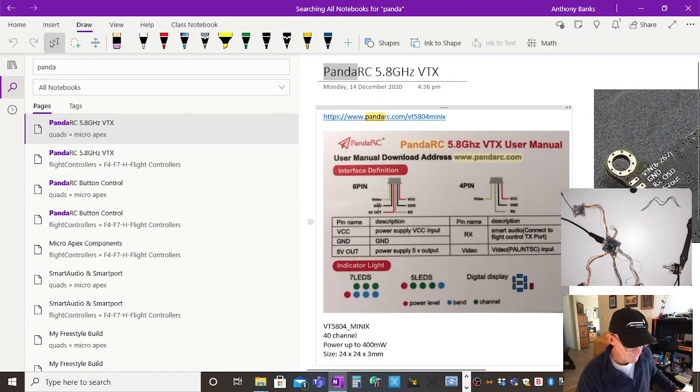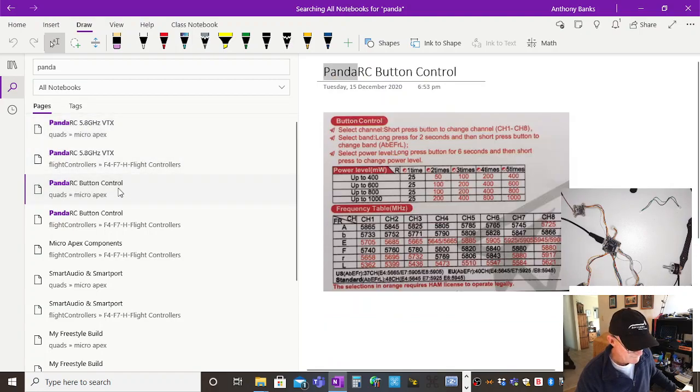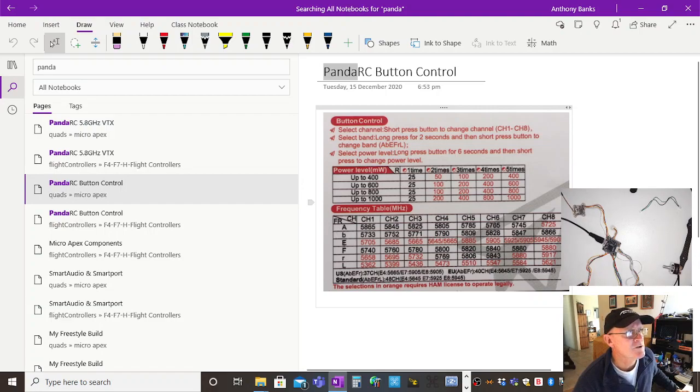Okay, so there's my video transmitter there. Yeah, okay, there it is. Can you see that? That's the 5.8 gigahertz band that we use for video, and the different channels and frequencies within the channel. So on channel A, you've got 5,865 megahertz, which is 5.865 gigahertz. You just move 3 decimal places. Come on, STEM students, you know how to jump decimal places by now. Megahertz is million, gigahertz is billion, 9 zeros. So from mega to giga is an extra 3 zeros.